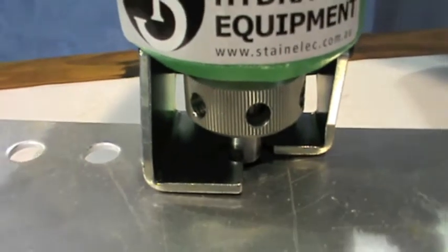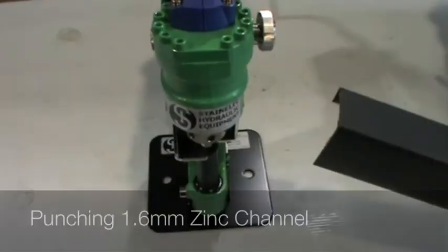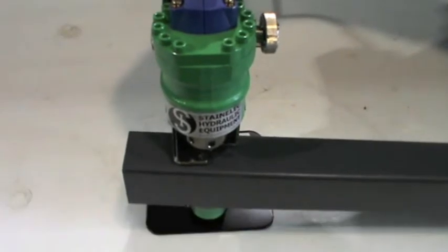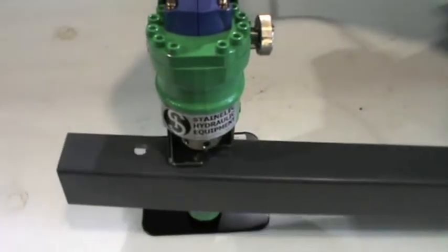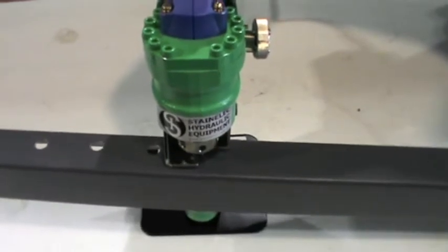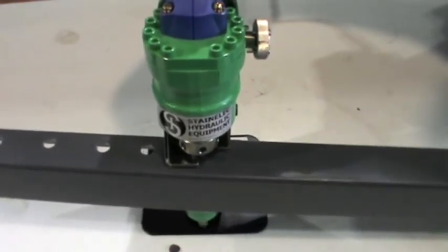Kamikura has a wide variety of punch and die sets from 4.5 millimeters to 13.5 millimeter diameter to suit the M40CR. The M40CR puncher delivers a hydraulic output punching pressure of 700 bar.